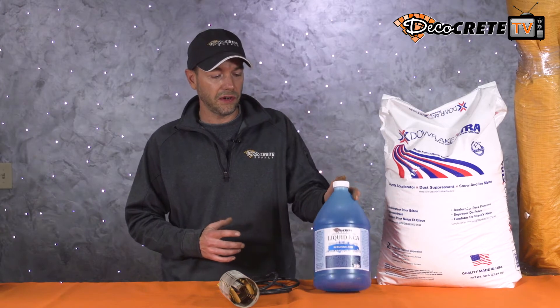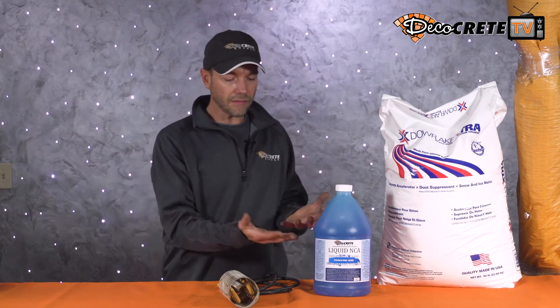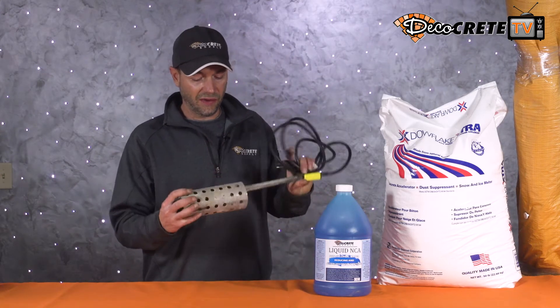Next up is hot water, and this goes right with the accelerators. Coming up in the next couple weeks, talk to your ready-mix plant — everyone's different depending on what part of the country you're in as far as when they actually start running hot water. Hot water with some extra cement can honestly do quite a bit for you. Also make sure you know what's going on at the plant. If you were using two percent non-chloride last week when they were running cold water, and this week they're running hot water, it's going to be a whole different story — it's going to go off a lot faster.